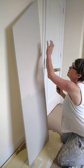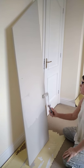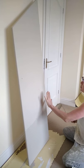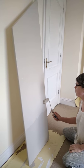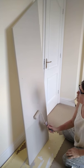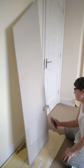You take off like a little arrow to avoid streaky marks all across there. Section 3: start in a dry area, push it out to the edges, covering bare areas. Section 3 joins back into section 2. And what is it? Lay off — whoosh, up, that way. This is just to make sure I don't get any roller marks where section 3 joins section 2. Chances are I wouldn't, but because these are doors that the client will look at every day, I'm not going to risk it.